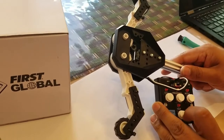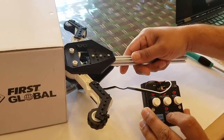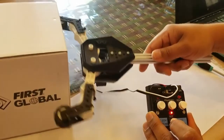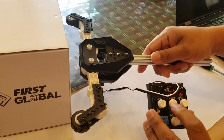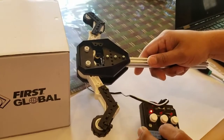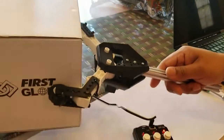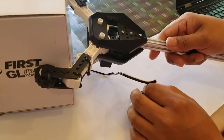You can see it's now been programmed. If I hit test, it should go to the position where it is gripping the block. If I keep this in test mode — when test is flashing — I can hit left to go to open, or hit right to go to the closed position. And now you can actually program that servo gripper. We can talk about how you might put this gripper on something else and how to use this programmer to test things.